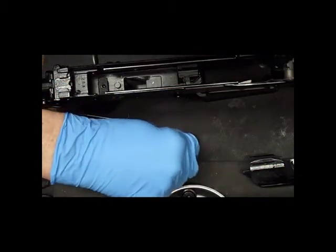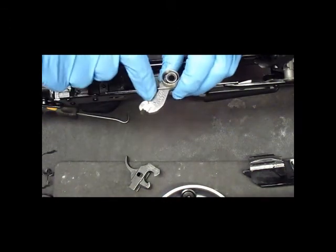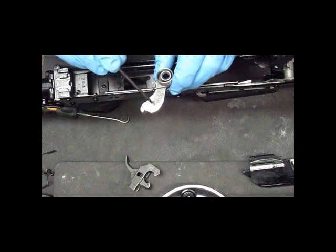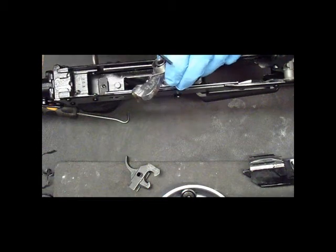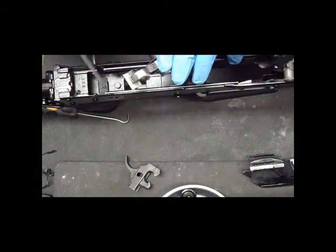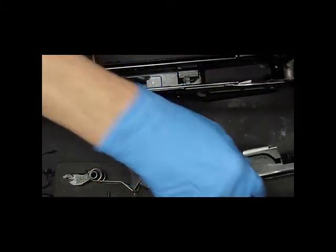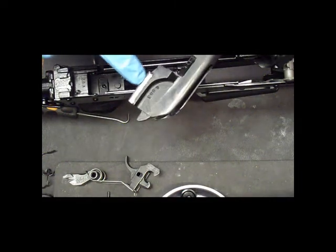Now with the hammer, what I also did was, you see these bumps? There's a bump there and let me get a nudgy here. There's a bump there and there's a bump there. Kind of hone those down a little bit so when the bolt carrier comes back across them, it doesn't have to really fight so much. It just rides up on it, pushes it down, and I'm hoping along with that, and I also polished up the rail riders.